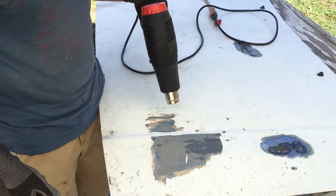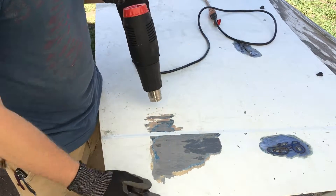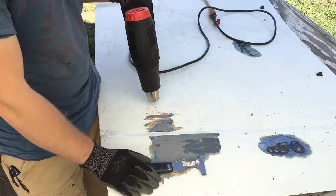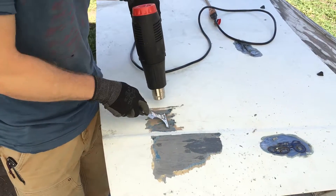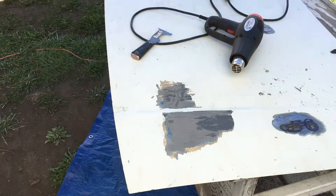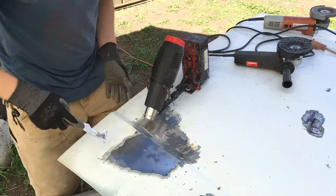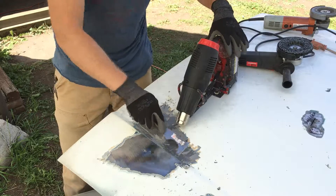You want to be more careful if you're doing this on a real auto body panel that you're actually using. This is just my test piece for our intermediate class to learn how to weld super thin metal. We'll see how it settles out once it cools down. For this project, this is a great way to get the paint off very quickly and easily. I'm using a tarp drop cloth down here so I can just gather up all the stripped paint and put it right in the trash. I found I could work a lot faster by using something else to hold the heat gun, so I can scrape with one hand and hold down the metal with the other, and just keep moving along and scraping the different areas.